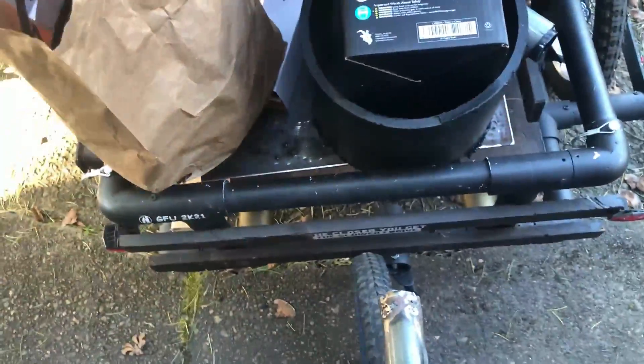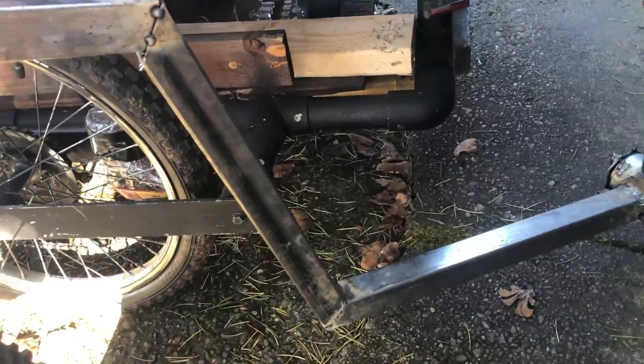The ground clearance is fantastic here. We're not riding this yet because it's not fully gusseted, and I still need to reinforce it because I've got a little bit of spreading. I'm going to add a gusset at the bottom and then triangulate from here to here, because I just realized I actually need this air gap to triangulate.